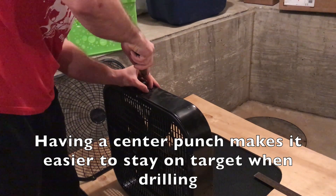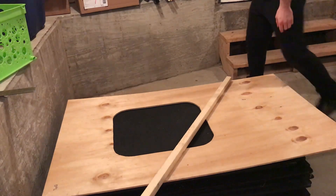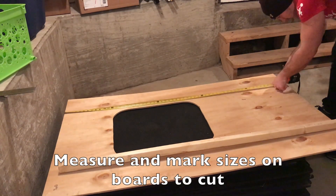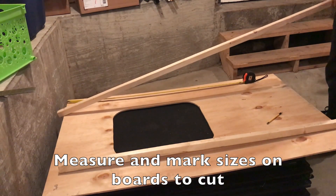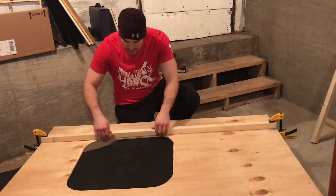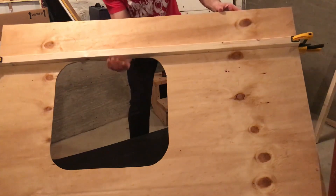What I'm doing now is measuring for the braces on each side. They're very different because there's not a right angle anywhere in this house — the door is very crooked. What I did was line up the board. The big thing to look out for is that you're flush with the inside here and not going past this board with your two-by-twos. Then I just clamped them in because we're going to be screwing in from the other side.